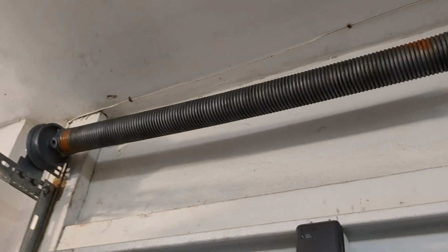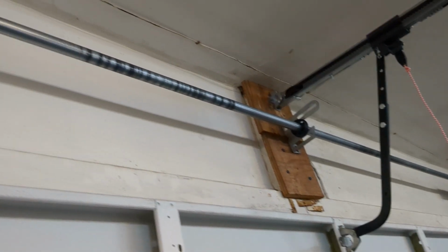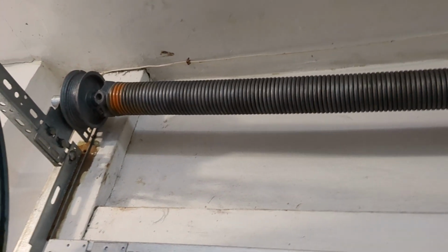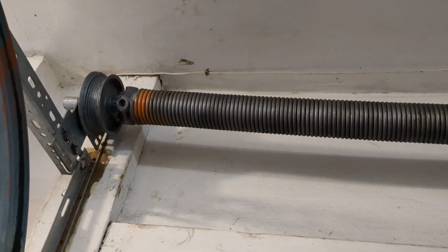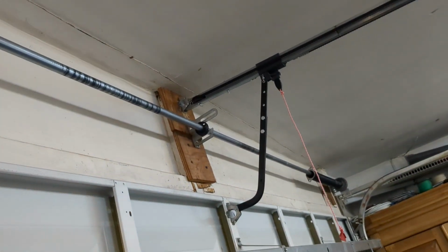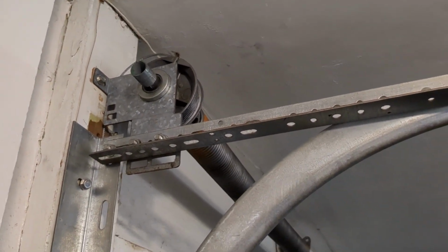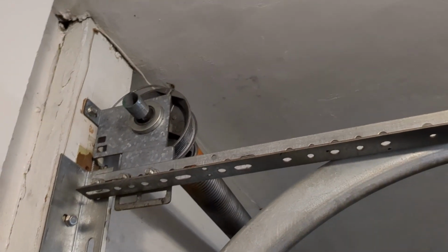Quick freestyle recap. As you can see, the springs have been released from tension and moved to the edge of this axle. What we're going to do next is take the same square screws that are on the hub, on that pulley thing, and open that up, release it on this end, release it on that end, so that we can move the axle off from the base, the actual bearing that's inside on that sheet metal.